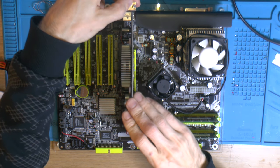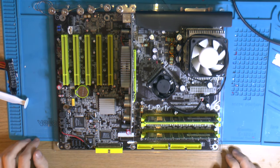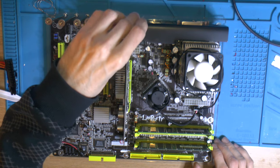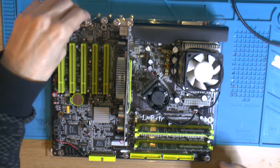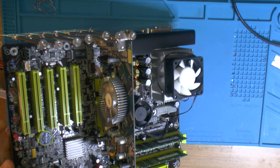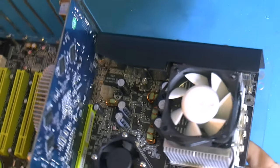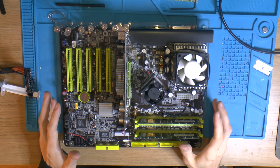Running at 2.4 GHz requires around 16°C inside and an AMD stock cooler — one of the bigger ones. Ideally you'd want water cooling at ambient temperatures and above. It's winter right now so it's cold inside, which helps. I'm using a Titan cooler — a classic heatsink with a copper base — with a different fan since the original wasn't there. Let's power it up and see what kind of benchmark score we get.